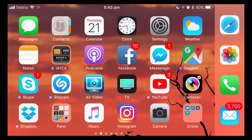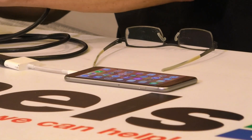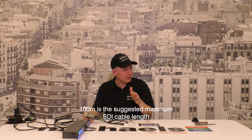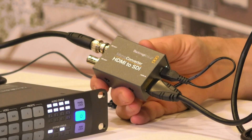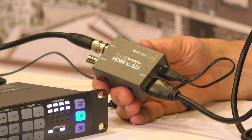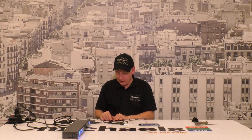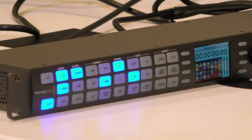So we have achieved that — we could use an extremely long SDI cable on the other end of the microconverter. The limitation on SDI cables is something like two to three hundred meters. There's no problem running long ones. Compared to HDMI, with the cost of HDMI cables and the thickness of them, you just can't beat SDI. A long powered HDMI cable is more expensive than one of these microconverters, so you can't beat the Blackmagic microconverters.